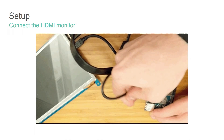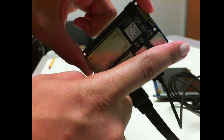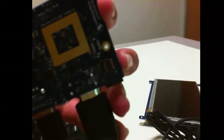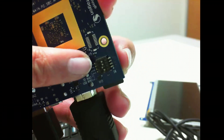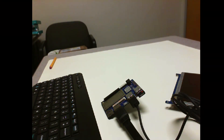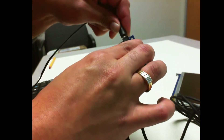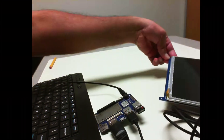Once you have made these connections, go ahead and add any other accessories you need — for example, the USB mouse and keyboard. Now we have the SD card, HDMI, USB to the HDMI monitor, and the Bluetooth dongle for the keyboard and the mouse. Let's look at the back of the DragonBoard and take a look at the switches. You can see the switches are already in the 0-1-0-0 position, so we do not need to modify that. Now let's turn the DragonBoard on. We can see that the USB has also powered on our touchscreen.